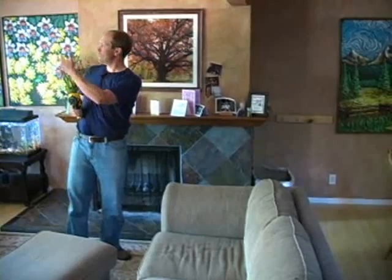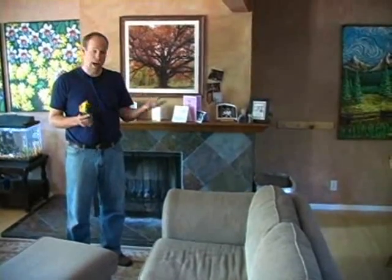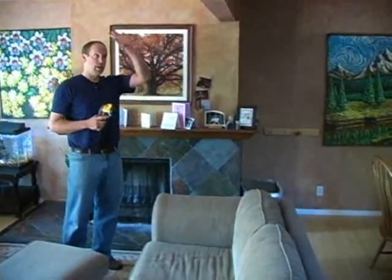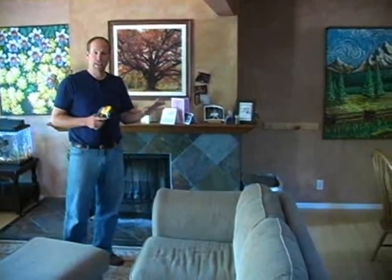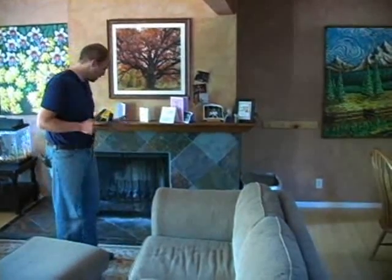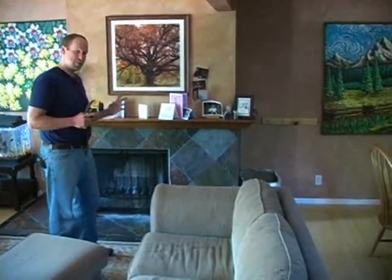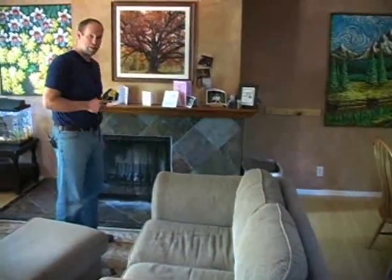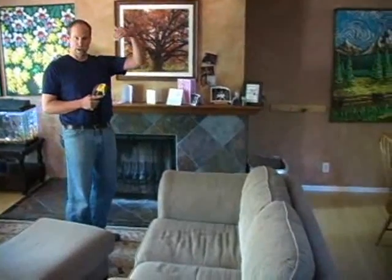And we're going to exaggerate air infiltration to look for hot air coming through certain areas, typically around gaps and defects, possible defects, apparent defects in the insulation barrier of the house, around windows, doors, wherever there's a penetration through the wall. We're going to take a look at the insulation value of the attic ceiling. There's an attic hatch, I believe, in this house. And if you're going to do it in the wintertime and the fireplace is on, that's really great because that's sucking a lot of air. You can get several hundred cubic feet per minute being sucked out of the fireplace during the wintertime. So you can look for cool air coming in.